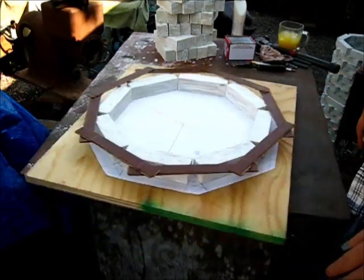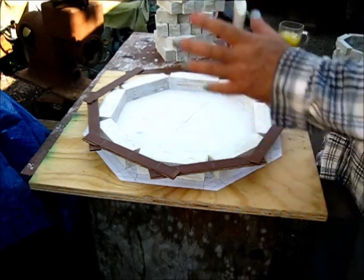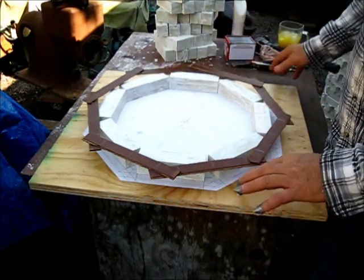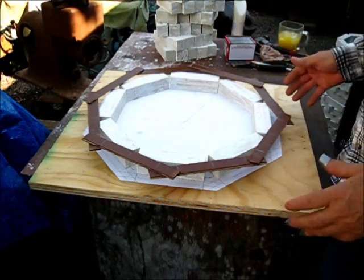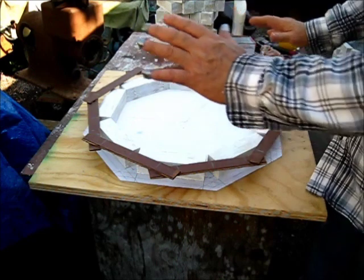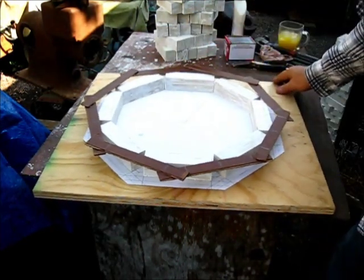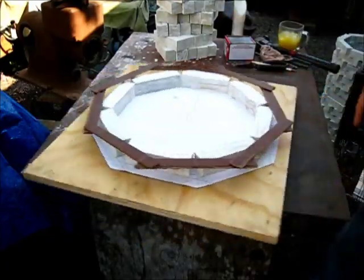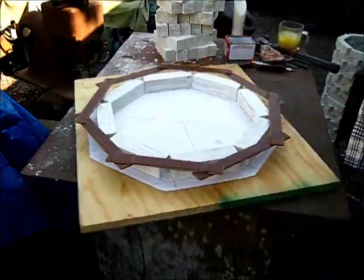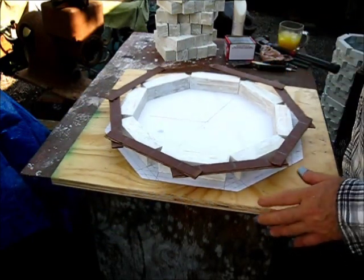The turntable. The way I did that is I raised it up, put something right underneath the center, and left it out here overnight. And then when I came back out here, the piece of plywood had warped and put a bow in it, a hump, because the outside edges went down. Then when I turned it upside down and put it down like that, only the center of it is the high place now, and it rotates. All so simple, but it saves you time.